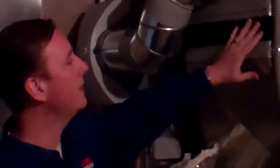So all of our systems, we go through and we completely seal them. Ours leak less than 10%, and we actually test that on the back end of every job. Also, we've got canvas here as opposed to straight steel. The canvas acts kind of as a sound absorber. If we just had straight steel, a lot of times you can get additional noise going through the duct system. So we put canvas on the supply side and the return.